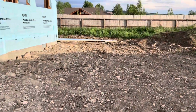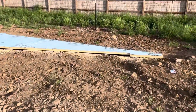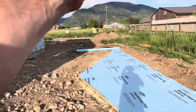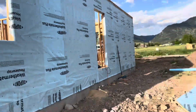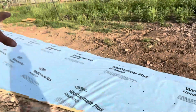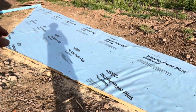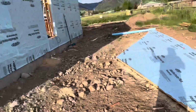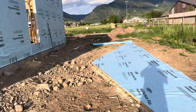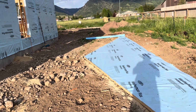All right, so over here, we laid this truss out, the gable end. We sheeted it. We cut along the top edge with the router, like we cut out these windows. And then we stapled all the sheeting down so it's solid. We did it on 4s, and then we wrapped it with an overlap, so when we set it up there we can overlap it. I'm a little worried that wrap is going to be in the way, and we'll take it off. I think I might do that.